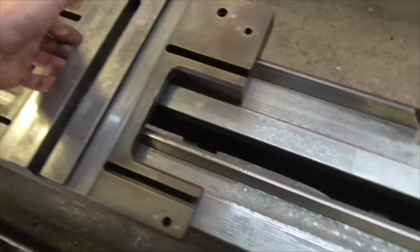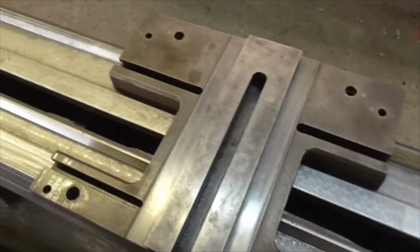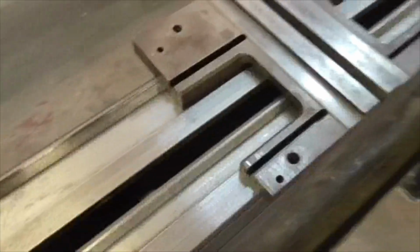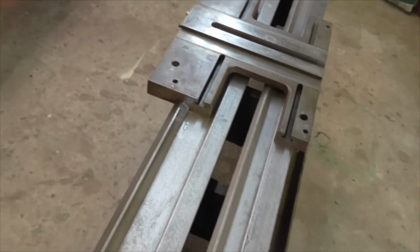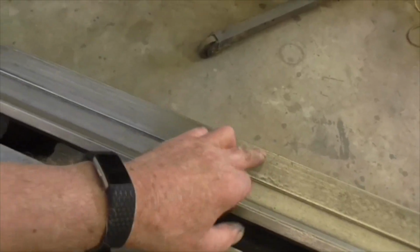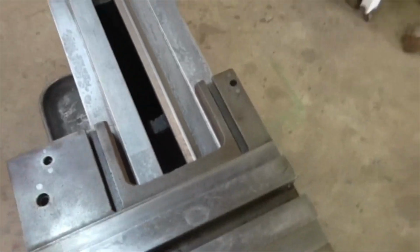And as I say, inexplicably, as you put this end over the worn area, it seems to come up rather than drop into it, which is what you would expect. I'm obviously going to do further investigation on this. If anybody watching has got any ideas on this, please let me know, because you get your head round these things and you start to think, that doesn't make any sense at all. It's a very wide bearing, but it does appear to be worn within the areas it would cover, which is hard against the tailstock probably, and the maximum distance, which is about there.